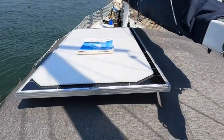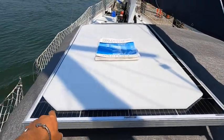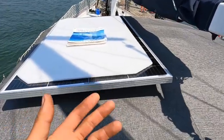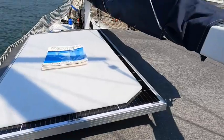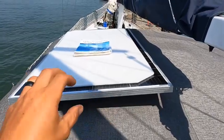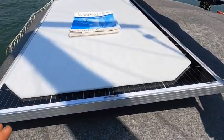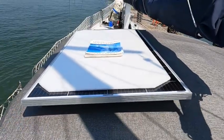You can see here it fits pretty good. One thing to note — I got it covered up because these create voltage when the sun hits them. When you have the controller hooked up it will control the voltage as it comes to the batteries, takes spikes and makes it a more streamlined charge. But these create power, and the ends are far apart. I don't think you'd ever actually have an issue, but better safe than sorry — these panels are 300 watts and put out a pretty good amount of amperage for 12 volt.